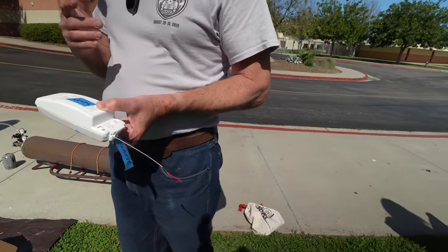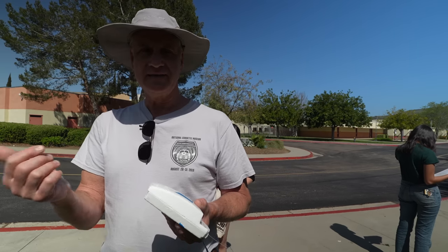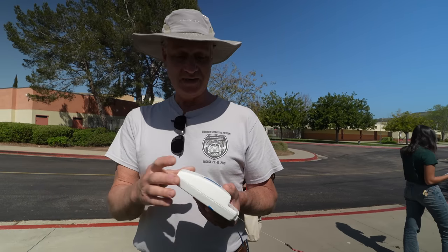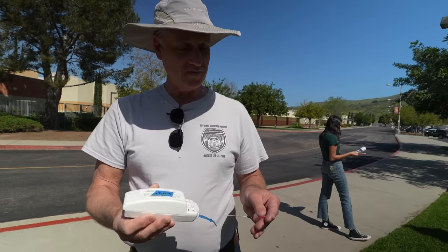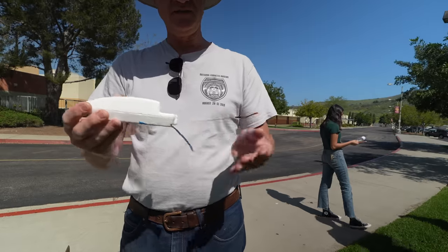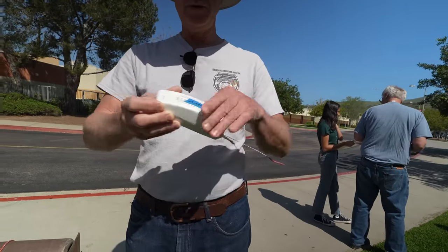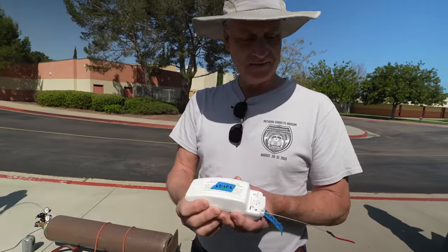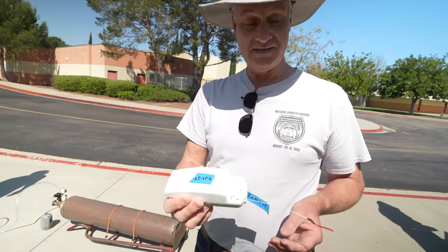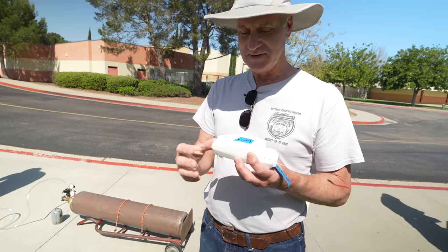We moved it from 400 to 430 megahertz, which is a shorter wavelength, and we made it longer — or so it seems. It turns out we actually didn't make the antenna longer. When these are stock, there's a long sensor for temperature and humidity which is an extension of the circuit board, and that whole length is your antenna. The stock one's wire ended partway, but it had this big long extension which was a sensor — also part of the antenna. So it seems counterintuitive, but the overall length is now shorter — we just removed a significant part that used to be attached.